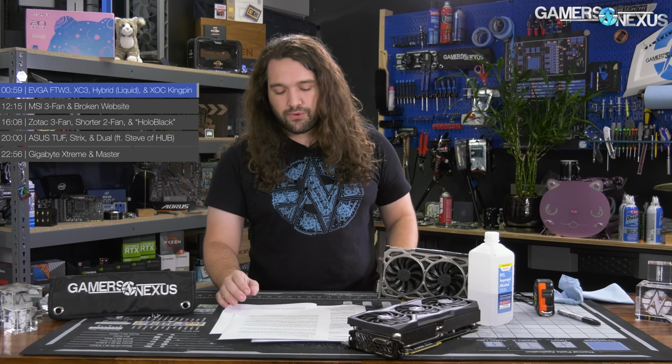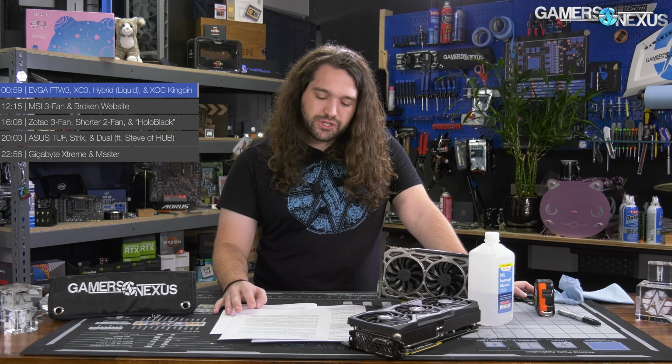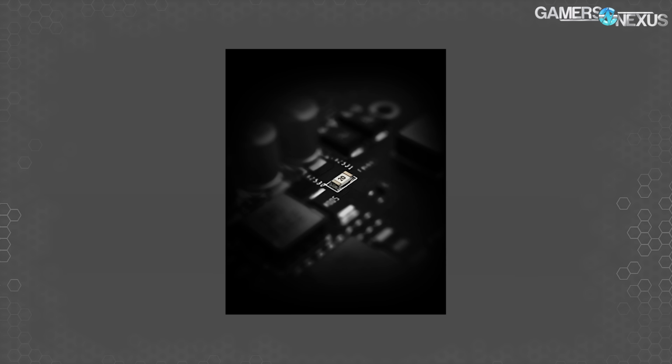For the power module, that just tells you the board power. It's measuring out the cables, so you get a more accurate power consumption number reported in software for the entire card, because there's a physical hardware module on there telling you. It's not approximating anything. This should be more accurate than something like GPU-Z, which is reading from the GPU silicon, so you're missing out on VRM efficiency losses and things of that nature, other stuff on the board, basically. So those aren't super useful for a lot of people, but interesting extra features to consider. Let's move on to the next group of cards.